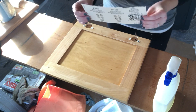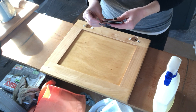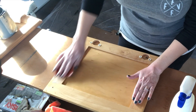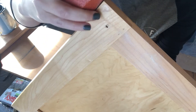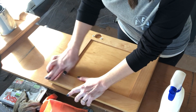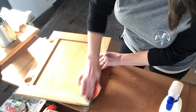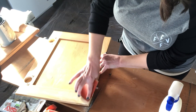So after you've done your first cleaning, you're going to start sanding. I like to use a medium grit sandpaper — anywhere from 120 to 150 works great. You can also use a sanding block, but I have found that it's easier to just use my fingers so that I can get into the grooves. Notice I'm going with the grain as I sand — this helps to eliminate scratches and brush strokes. Most cabinet doors have felt bumpers on the top and bottom. You'll want to sand off all of the residue left over from the adhesive so that your paint will bond to that area.